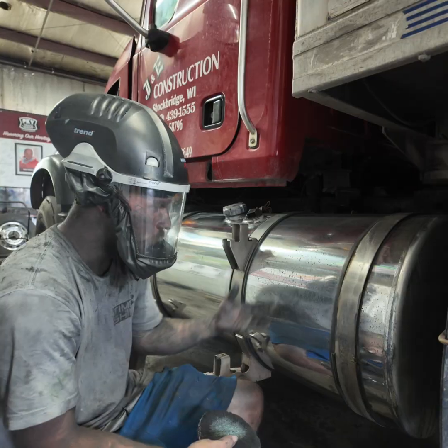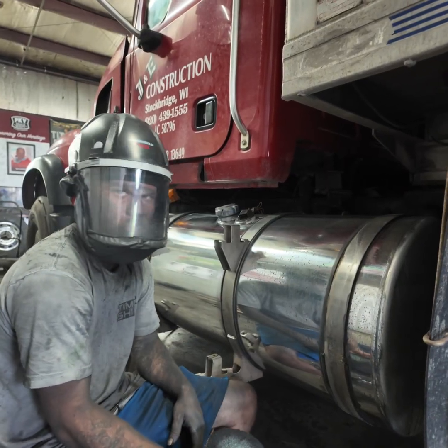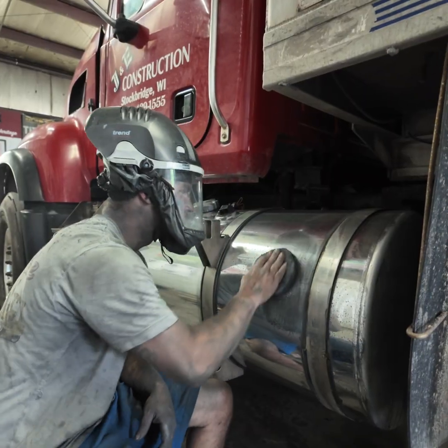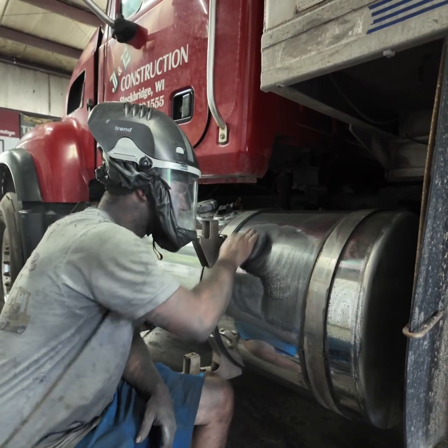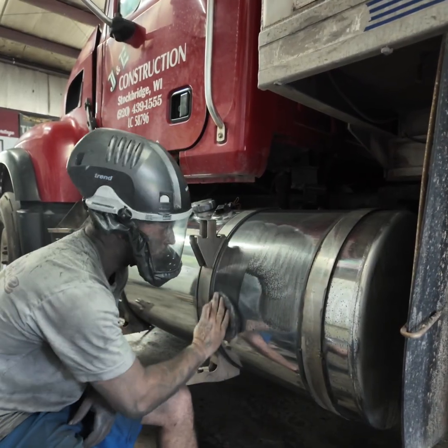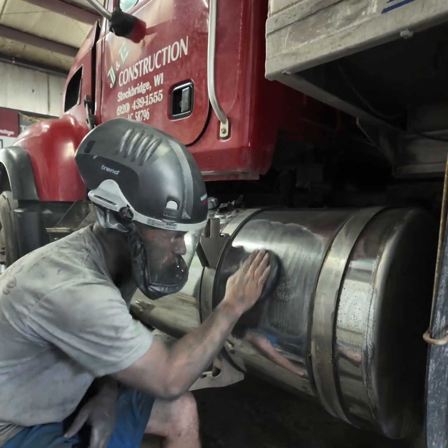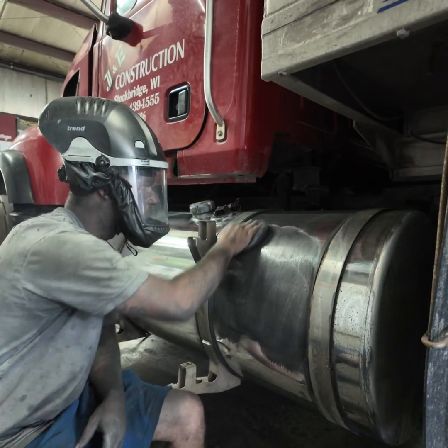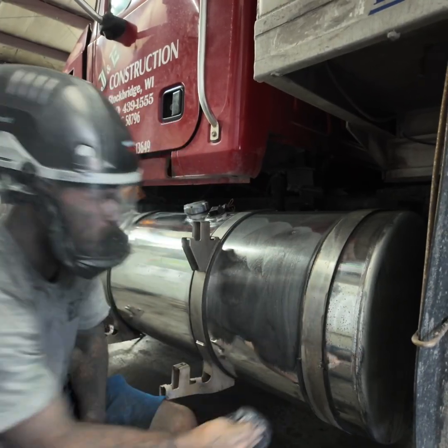We're about to color his tank that y'all just watched me cut. First, like I said, it was a rougher tank, so we got a little bit of rouge hung right here in the pits. We make shiny pits around here. So if you'll take a little hand polish, just rub on them rough spots where you got that rouge, where it just hung the rouge. Hand polish just cleans it up. Just gets all the rouge there. That way whenever we color, we can go right over it and pull it off.